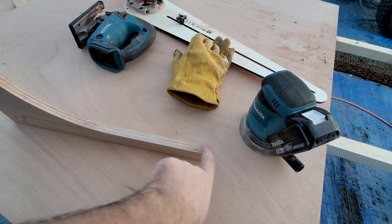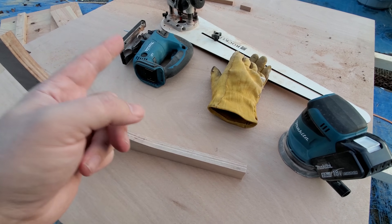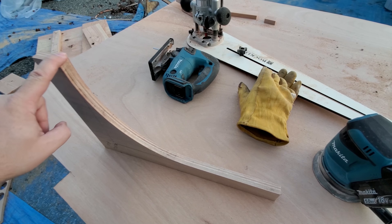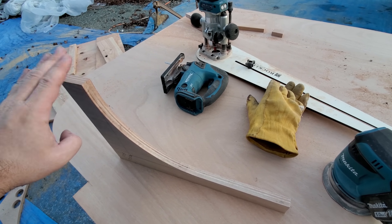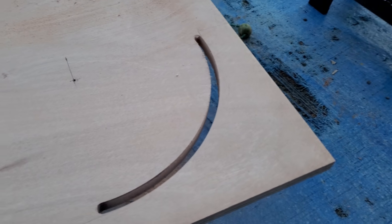This should be the perfect length of that cabinet face — 7.25 inches from here to here is the cabinet face, and then it's a 7.75 inch radius that comes up here. There's a one inch back block over here, and that's what takes it around the final distance on the countertop. We got the second router cut made — a real nice radius, everything came right in line.